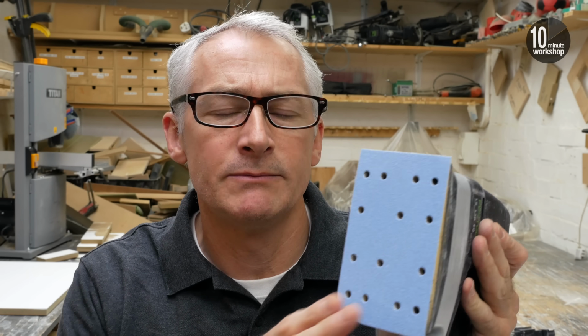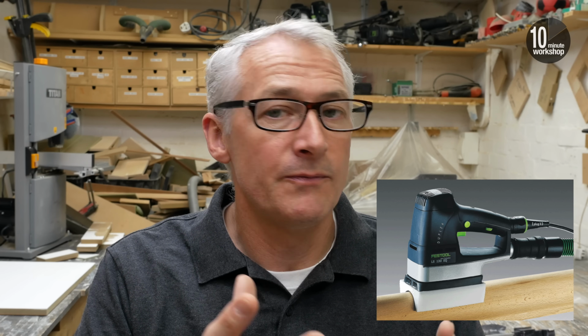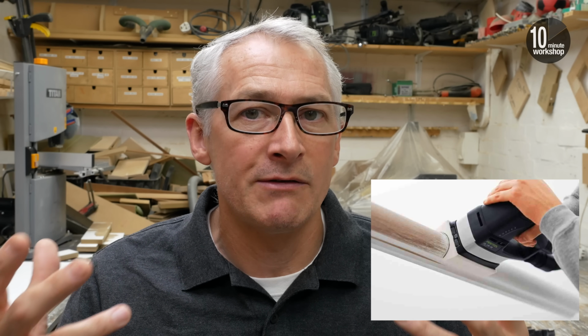Okay, moving on to a slightly oddball sander. This is called a linear sander. Literally, the pad just moves back and forth, and it's supposed to mimic hand sanding. It's sold as particularly for painters and decorators, where if, for example, you've got a whole house worth of handrail of one particular type to sand, what you can do is they make like a solid urethane foam pad. You could put a piece of abrasive over the handrail, use the foam pad against it to take the shape, and then you can stick your abrasive to that, and then you've got something that's the perfect shape for the handrail. You would have to have an awful lot of handrail to make that worthwhile, I think.